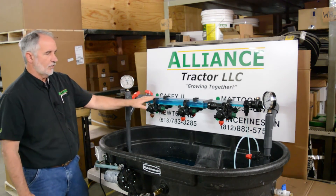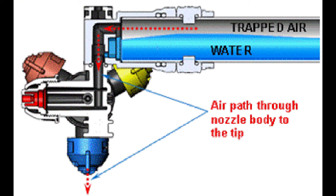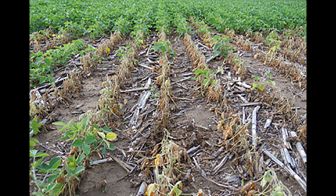The other thing is we don't have air trapped in here, so we're moving all that product out. This is a cutaway of what happens in the end of this cap. All the air is traveling above the pipe and it comes to the top of this cap at the very end of the boom, and that air is discharged out through the boom — that's how we get rid of trapped air. Also, we're spraying chemical at the very bottom of the boom, so we don't have trapped chemical after this nozzle body. We've all seen this at the end of fields when we switch over from corn to beans or beans to corn, and this helps eliminate that for a better clean out of the boom.